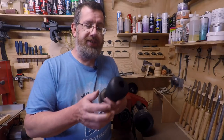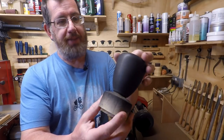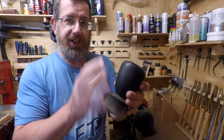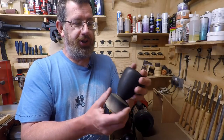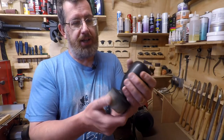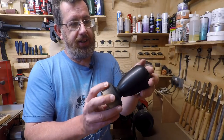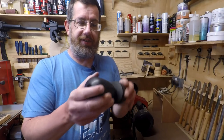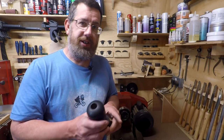I've cut both back to 600 grit. The ebonizing one still has that visual pitting effect, which probably isn't what it should look like. The paint has come out nice and smooth with more of the expected effect, though you can see very slight sanding marks from the 600 grit paper. I'm going to hand spray both of them again with the lathe not running.